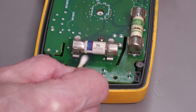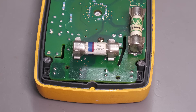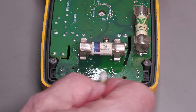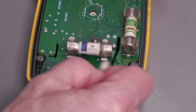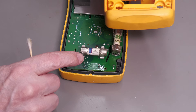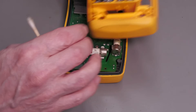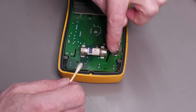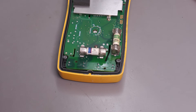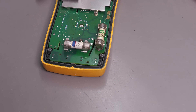Whilst I'm here I'm cleaning up the residue on the back side of this PCB — it is in quite a state. Getting most of it off with the q-tip. I think it's actually not water damage — it's just dirt getting down through the cavities to where the fuse access is, spreading around each side around the fuses. I think that will do.